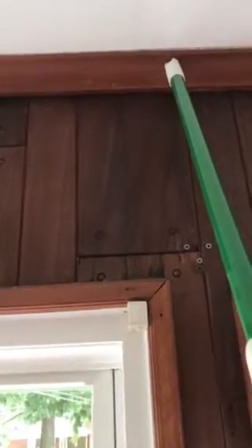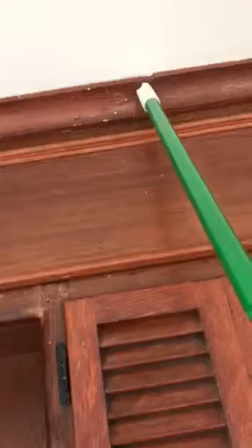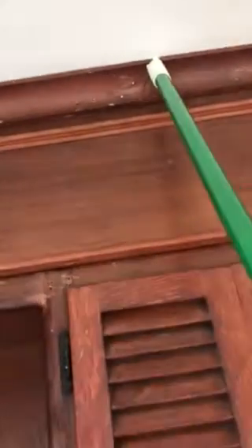I'm gonna use a broom handle to show you, but several pieces of the trim I would like you to push up a little bit and then nail it again. Take that silver nail out, and then all these other silver nails that are here you need to countersink. Same thing up here — you've got four or five nails right here in this corner; this needs to go up a little bit more, hit it again with another nail and countersink these nails.